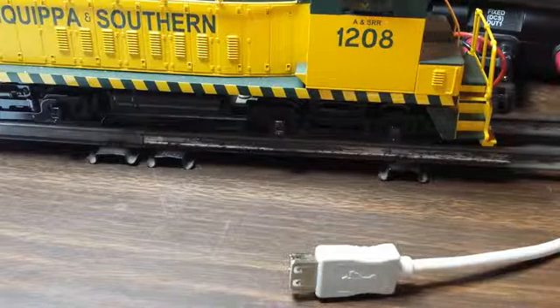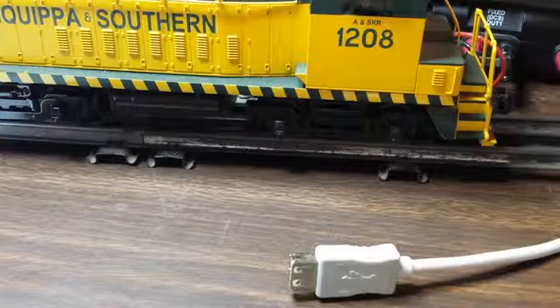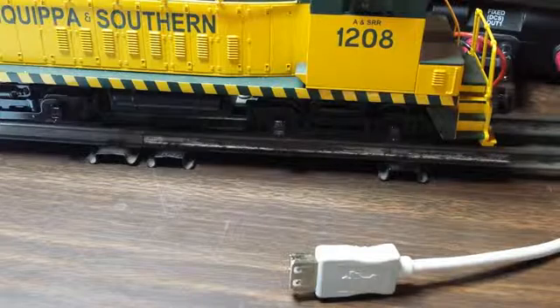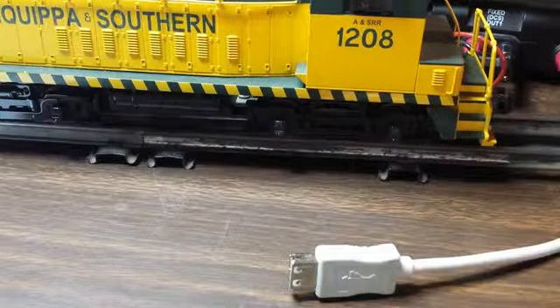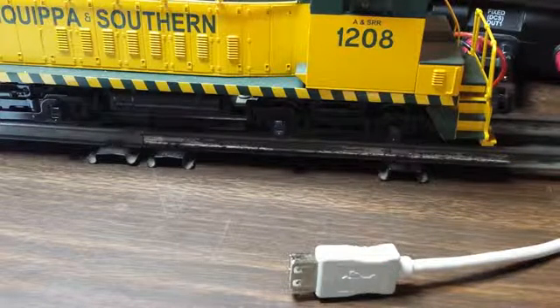At the same time, I found another post on the Internet that talked about the radio chip that was in the remote, and that was also the Texas Instruments TRF6901. I dug up the spec on that chip and learned that indeed it does do the OOK protocol, along with a frequency shift keying protocol.